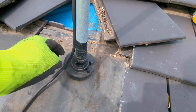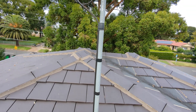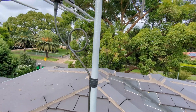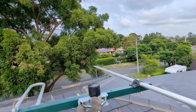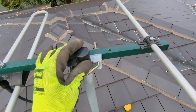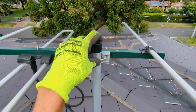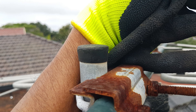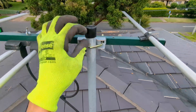If the flashing around the base of this type of TV aerial is done correctly, then chances are you will have a maintenance free TV aerial. But things can always go wrong. Even with this style of TV aerial, there is one weak point that we've missed on many occasions, and it's because the pole goes through the roof. If you look at the top of the pole, it's just a pipe and it's got an open end that's blanked by a plastic cap. And when the plastic cap starts to deteriorate and cracks, water goes in through the cracks, dribbles through the middle of the pipe and then goes into your ceiling cavity.